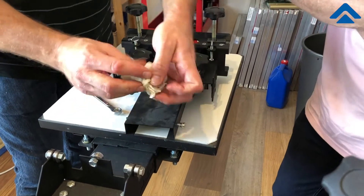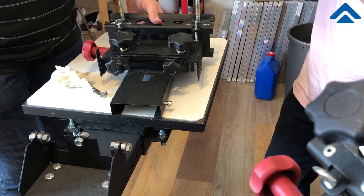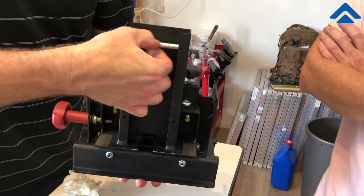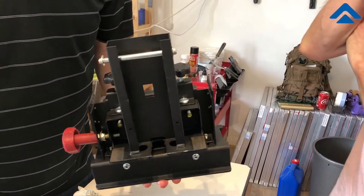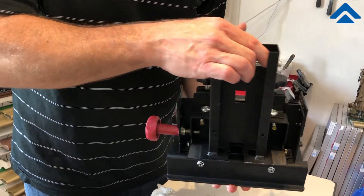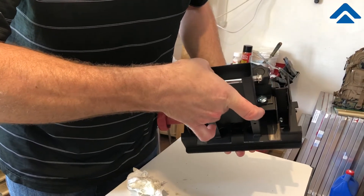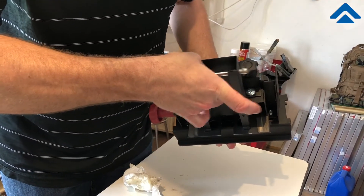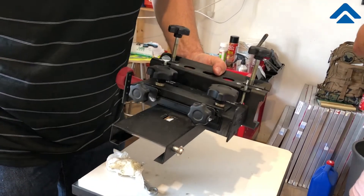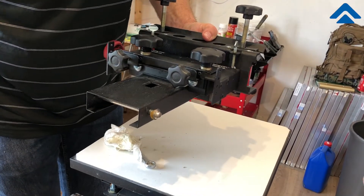This shaft fits right into these grooves here and floats inside this hole. Typically I'll take a little bit of grease along the inside of the shaft, a little bit on the inside here, and I'll rotate the shaft and slide it back and forth to get that grease along the moving area.